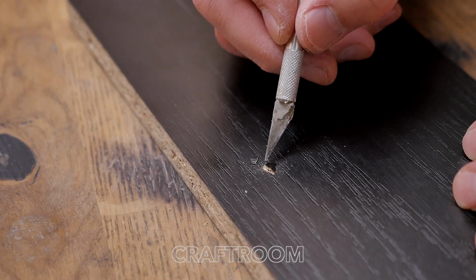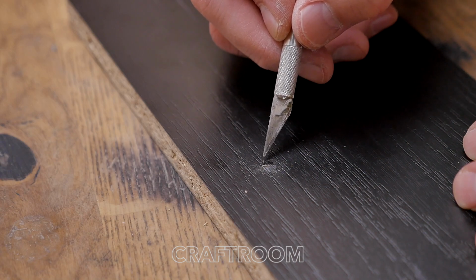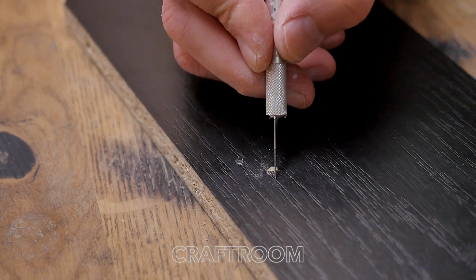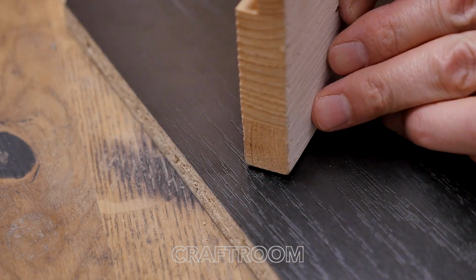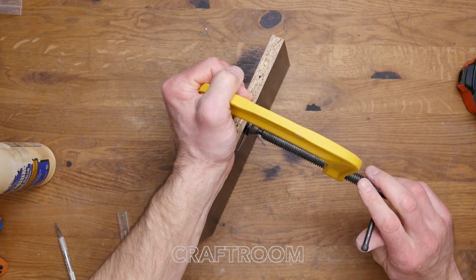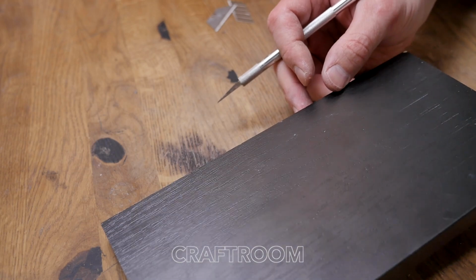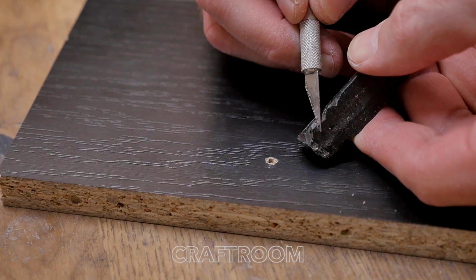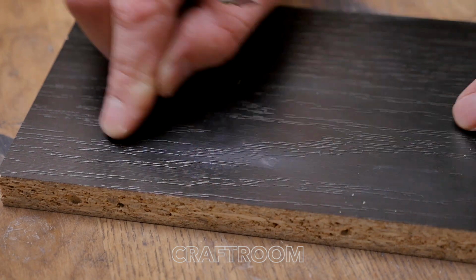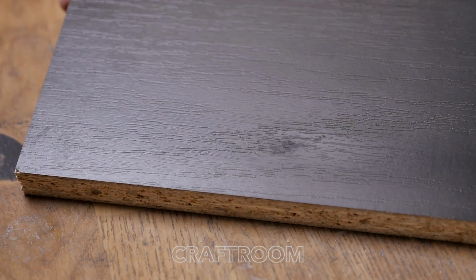Now you need to remove all the excess sawdust from the races and try to put the puzzle together. So the puzzle seems to add up. We add a bit of PVA adhesive. Press it with a bar. And gently fasten everything with a clamp. Now it is not such a big deal, not so noticeable, except perhaps on closer examination. If you need to close up such a hole, then of course you can't run without a corrector. But again, only a closer scrutiny reveals it.